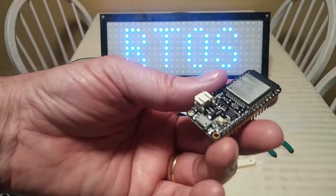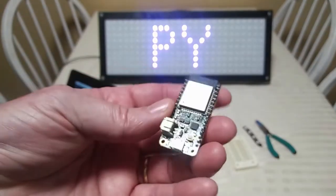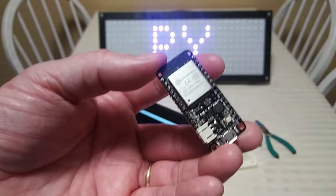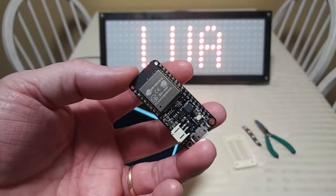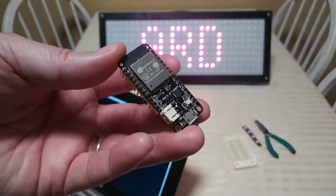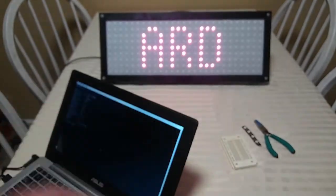The really nice thing about the ESP32 and its real-time operating system is that everybody's writing programming environments for it. I've been writing in Python — there's a project called MicroPython you can load onto these things. It's also got four megabytes of memory so you can write a lot of programs. There's also a project called WhiteCat that runs Lua on these things — a really nice project. It's a powerful 32-bit chip with all the connectors and features you'd want.